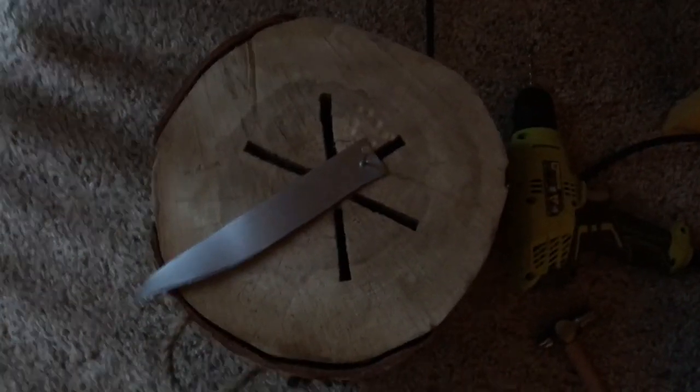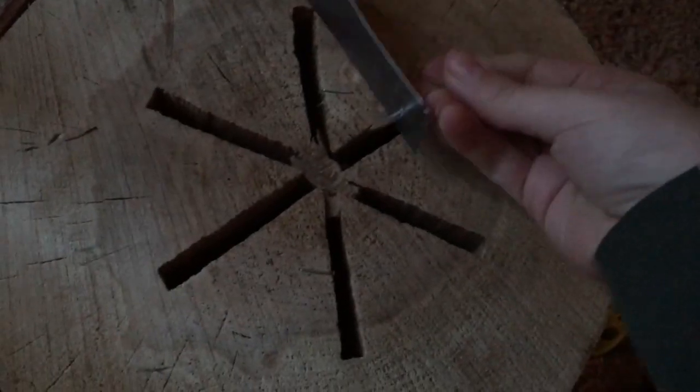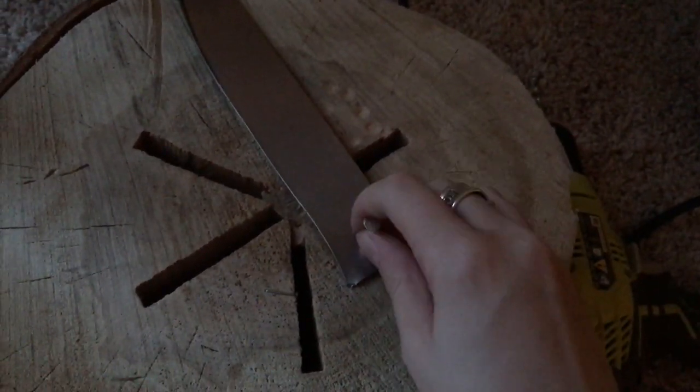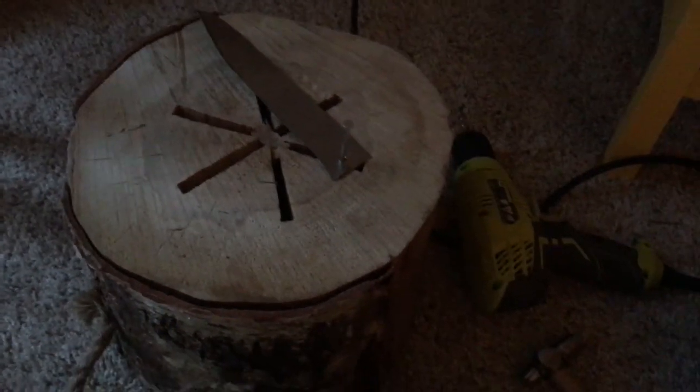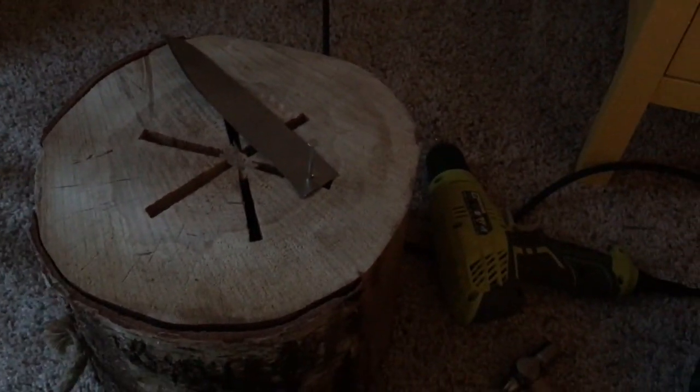Super important update: the drill does nothing on the 22-gauge metal, but hammering a nail in does. So I'm able to get through and rivet together my 22-gauge steel — I can get the nail to pierce it. But with the 16-gauge steel on the grill, it's not doing anything. So I'll probably just revert to using decorative rivets, which is totally fine since it's an independent piece.